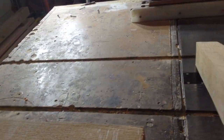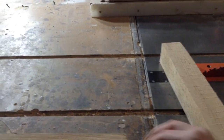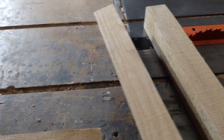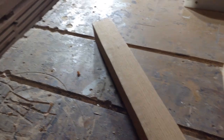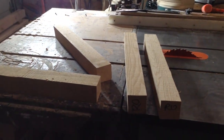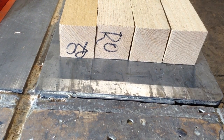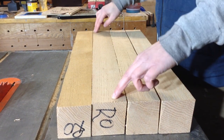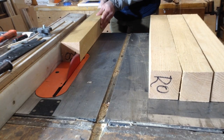To start, I'm going to start with the four corner legs. I got this material off of eBay - I've had success getting lumber like this off eBay. These were supposed to be three-inch legs, but the problem was they came a little undersized, and by the time I finished them they were about two and a half inches. That's the problem with getting supplies from various suppliers. When you buy three-inch material from a lot of places it's similar to buying four-quarter material - it will be a little thicker than what you need and then planes down to size. This was already undersized but I did make it work.